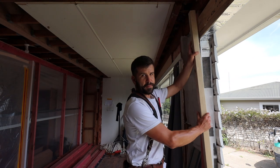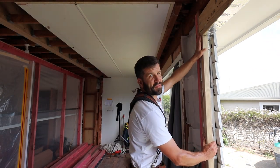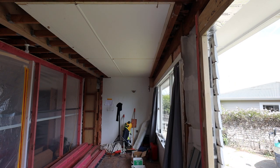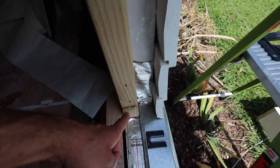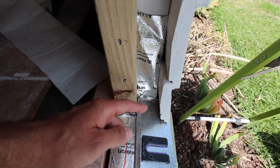This is part of what I mentioned earlier about the sill tray. In order to have something for the door jamb to fix to, I need to add this piece of wood, so the door jamb has something to fix to — and even more obvious here, the door jamb has something to fix to while maintaining that gap.